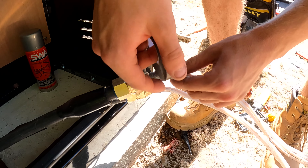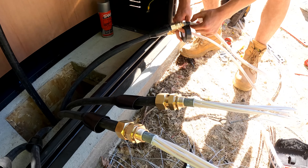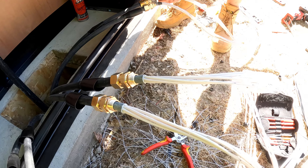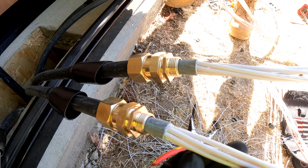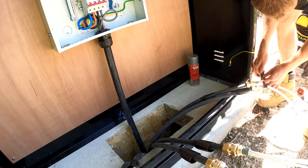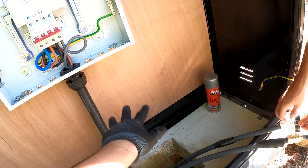This company made their own pole — they wanted Shell Recharge with their own pole to save a bit of money but they basically made it wrong. There's a little cutout here and there needs to be a U-shape for the cable to come in, so we had to cut a big hole out of the pole for the cable to sit in. Mounting it was a bit of a nightmare — the two bottom fixing holes needed to be slightly further in, so we had to do some core cutting and get a little washer on there to fix it back.